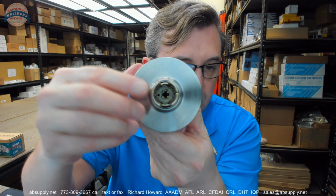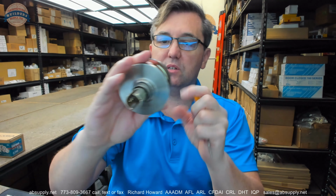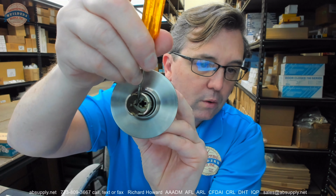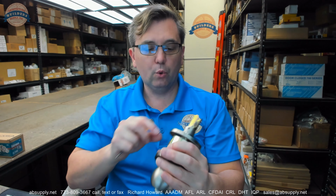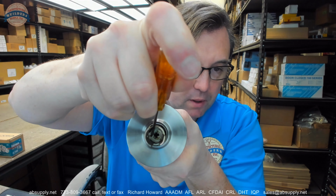However, I want to illustrate what I was talking about earlier. So that C-clip is right there. It's shaped like a C, except that it's on this side. Tiny little hole. Well, here, let's do this. The C-clip won't be able to easily do it. There is an item right here. You see that little hole? Well, that C goes all the way around there and there. When you insert the tool into the hole and push, it will depress that C-clip, allowing it to pull back.